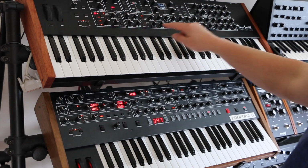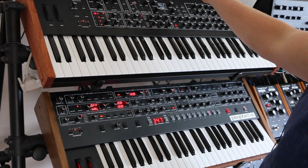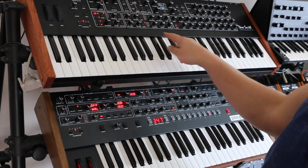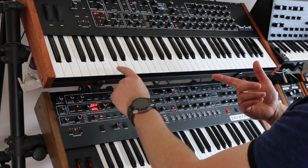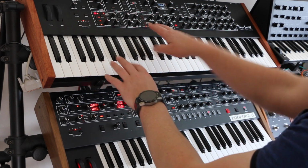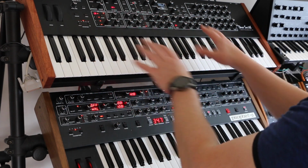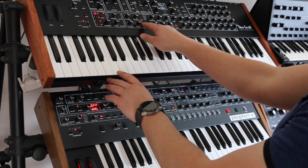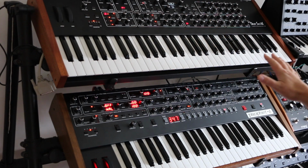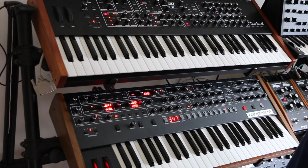One thing I've noticed with this one, this is actually going back because it's got an error in the second oscillator. If I go to this, you listen to one of the voices. So it's doing that on voice 8 on different places on the keyboard. And on this one, I'm getting bleed through one of the voices. You probably can't hear it on the video, but in the studio, it's there, it's loud.